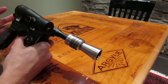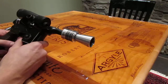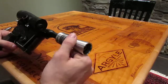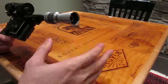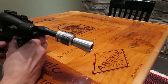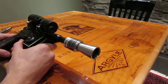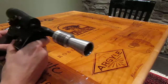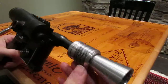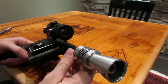So when you try to do that and there's a clear or a gray or a silver anodize on there and you don't know it, you ruin the finish of the anodized coating, however you want to say it, and then you have to completely remove all of the anodizing in order to make the finish homogeneous again. Really annoying. Obviously, it's one of my big pet peeves, in case you couldn't tell from that little rant, but I did remove it. I did weather this the way that I wanted to. I got this weathering just about perfect from the prop pictures that I have.